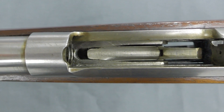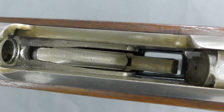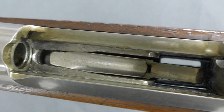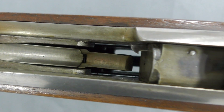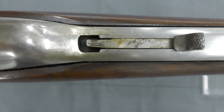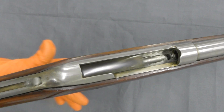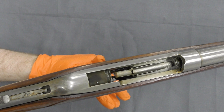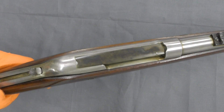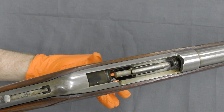Let's take a look inside the action. From this angle we can see into the chamber and the recess for the extractor on the right. In the centre we have the cartridge lifter or follower. Moving backwards, we can just see the gap which the empty clip would have passed through, and the front of the bolt projecting up out of the wrist of the stock. On the right of the bolt we can just see the extractor itself, and further back we have the striker assembly with its thumb piece. In this slowed down footage, as the lever goes forward we can see it unlocks the bolt dropping it into the wrist, and we can also see the striker being cocked. This leaves enough room for the follower to push up the next round out of the clip, and as the lever is brought forward again it chambers the round and closes the action with the rear of the bolt locking against the rear of the receiver.